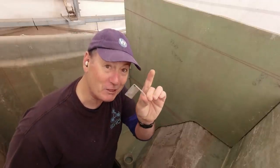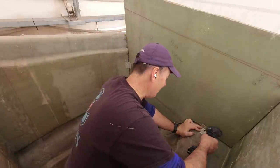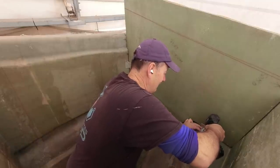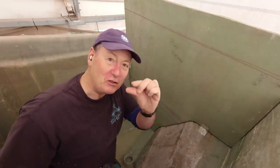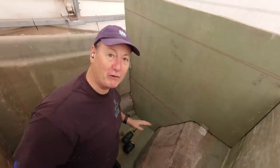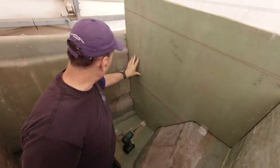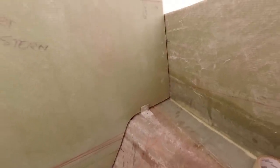Very important. Cover it with tape or it's going to become part of your bulkhead, and we don't want that — we want some nice neat lines here. I've got 30 mil foam up here so I'm deliberately using short screws so I'm not penetrating the hull, and then it just gets backfilled with vinyl ester and cotton flock. That's now in — can't go anywhere else. I can lift it out, lay my bead of vinyl ester and cotton flock, sit the bulkhead in, leave it for 10 minutes.